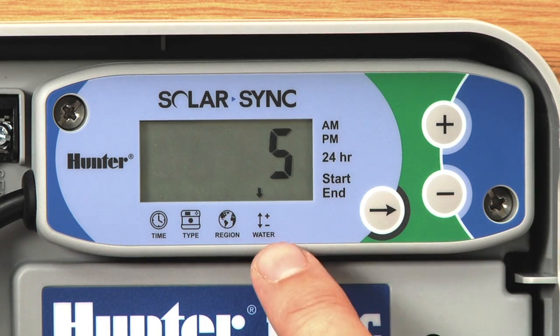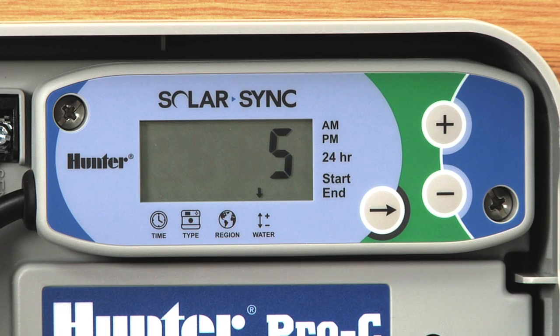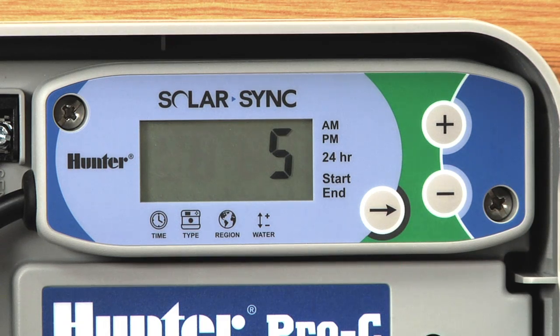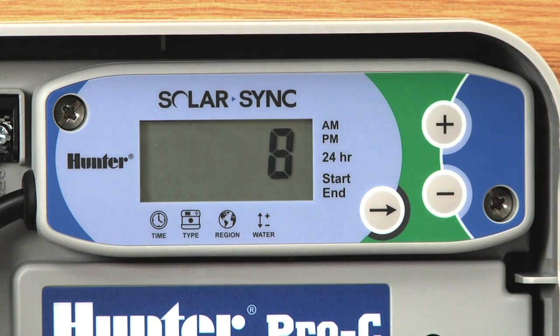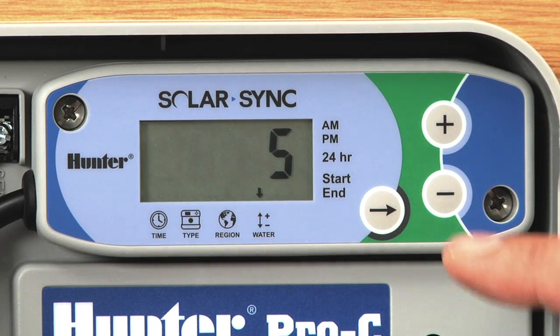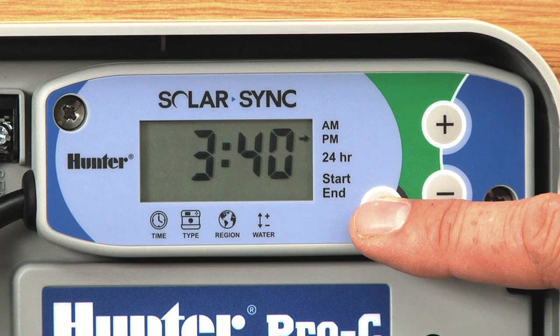The last selection is the water feature — plus and minus. It shows an arrow up and down with plus and minus. It comes from the factory at a setting of 5. That setting goes from 1 through 10 and is a way to either increase or decrease the overall amount of water adjustments the system makes. If your system is overall on the dry side, you can hit the plus button up to 6, 7, or maybe 8 and try that for a few days. If you want the water to adjust a little bit less, you would go in the minus direction, down to around 3. As you hit the right arrow it goes back to current time.